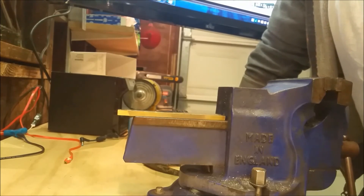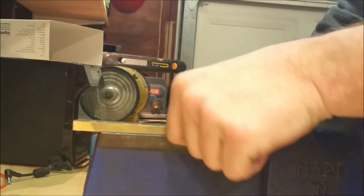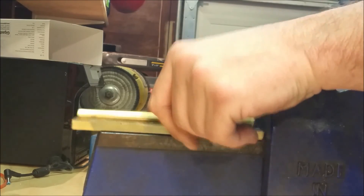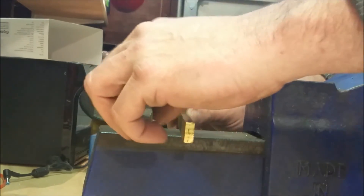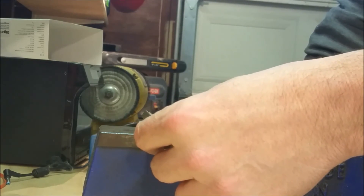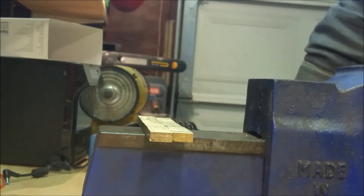I've got the gibs straightened up a little bit. Obviously we need the angles and need to tone them down. I'm actually kind of happy that the brass gives the way that it does, because with the set screws it will do a better job. Anyway, here are the two pieces for the two gibs — we need to mill these and put an angle on them. I've got to figure out how to get that exact angle and smooth these out. I'll conclude this video and do another one getting closer to what we need. Thank you all for watching — if this is interesting to you, please subscribe to my channel.